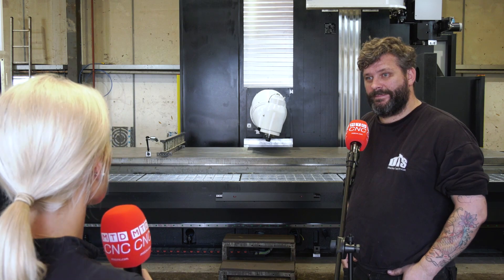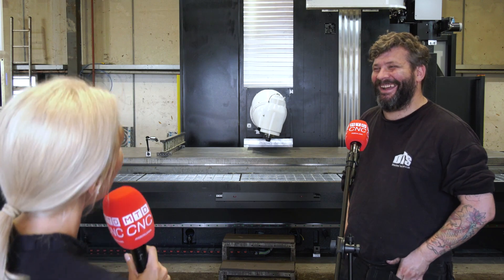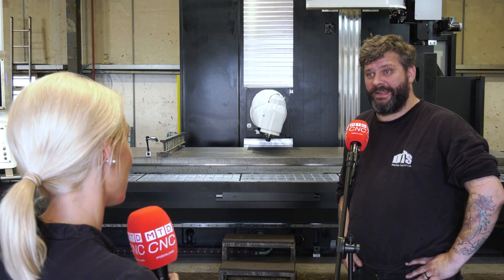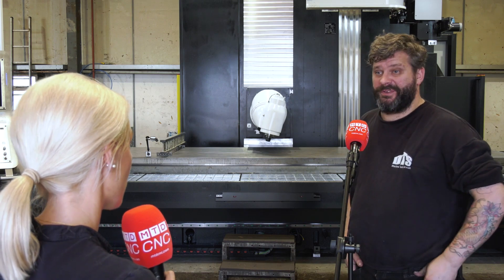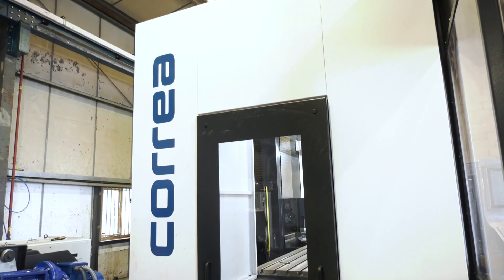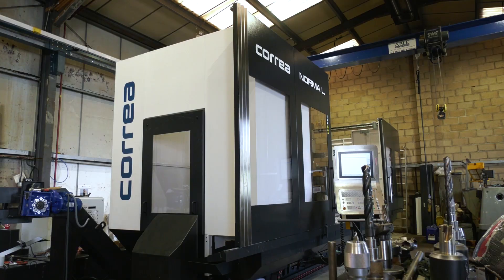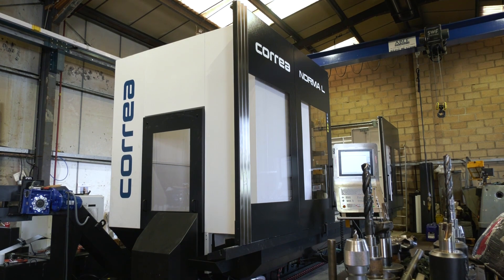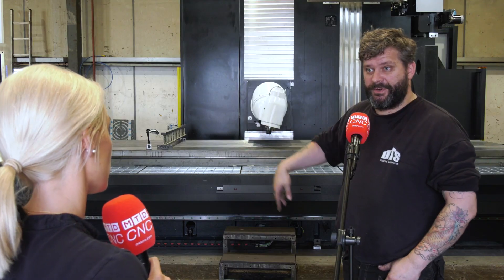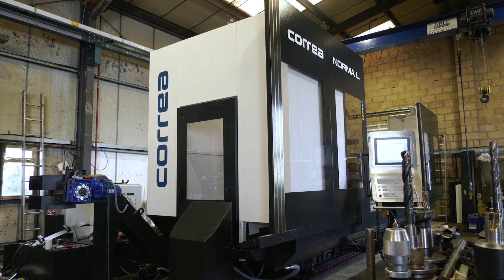What's the installation on a machine like this? Nothing's easy — we're looking at a two-week installation and we're two thirds of the way through it now. Most importantly is the foundations. If the machine hasn't got a sturdy enough foundation, you'll never achieve the accuracy it's designed to do. Initially a big pit is dug 1.5 metres deep and then filled with high-density concrete.